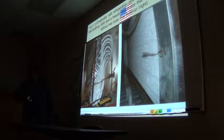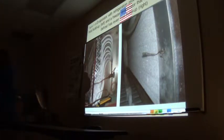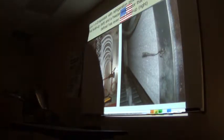Oh, okay. Are you supposed to use a brush to clean the fin? Yes, you do have brushes to clean the fin. Fin comb. They have fin brushes, fin comb, fin whisk. And they also have chemicals you can clean up with. Then you got dry back, right? No, not the evaporator. It's self-rinsing. Now they have condensation that rinses it. For the fins? Yes, you spray it on and allow it to stay there for about 50 minutes, then you turn on the system. The condensation that forms washes off whatever crap is on there.